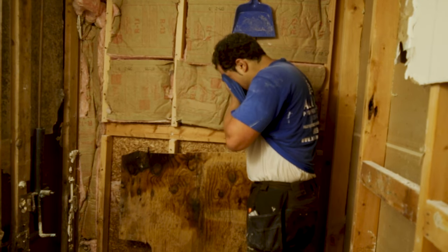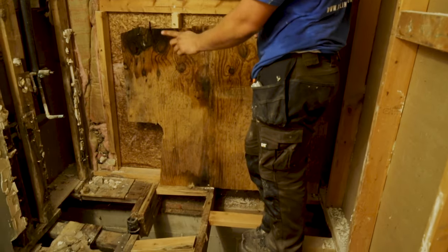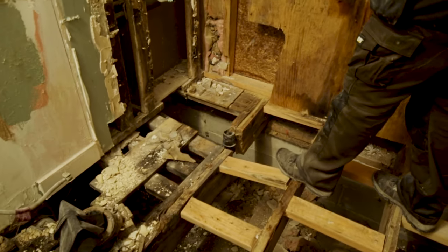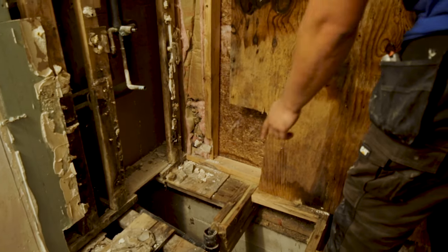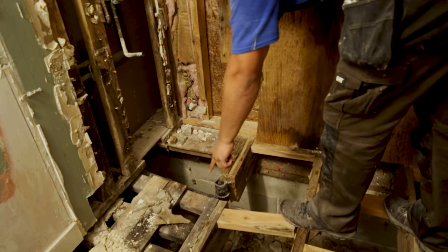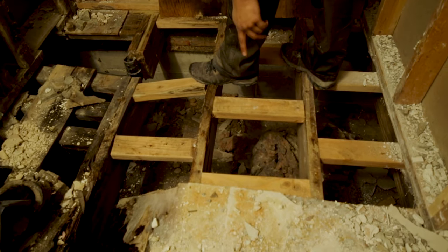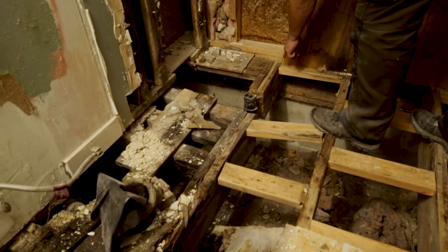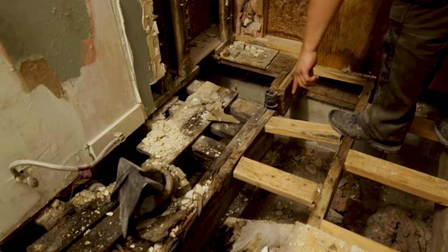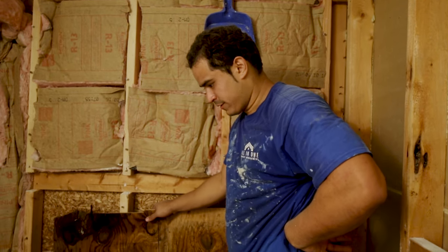I can jack that up from underneath. What I wanna do, so this is gonna be a left drain. This drain has to get pushed back, okay? We're gonna jack this up, get it level with the existing joists that are sound. Then we're gonna put some blockers in between, and then we're gonna sister this. One, sister it, two. Oh, and that'll be sound. That'll be perfect.